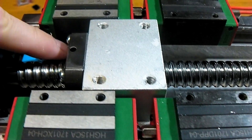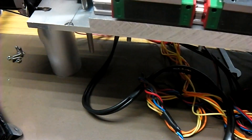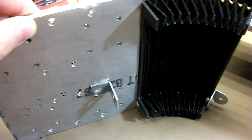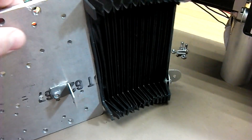This one can actually detect the metal of this nut as it moves in. On the other end I've placed a small right-angle aluminium piece onto the bottom of the spindle mount plate. As this approaches the sensor, the sensor detects this piece of metal and then will stop.